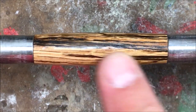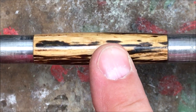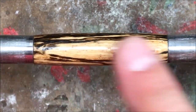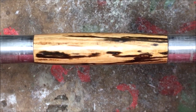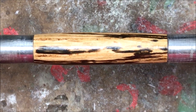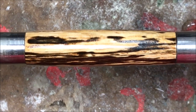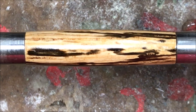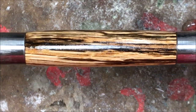What I'm going to do now is micro mesh the blank. I don't think I'll record that process — you've seen me do it many times — but I'll come back in a few minutes when the micro mesh is done and we'll take a look at it. Then we'll put some Renaissance wax on the blank. I think the CA finish turned out really nice and I'm ready to polish it up with the Renaissance wax and then get the buffing wheels on to see what we can make this blank look like.